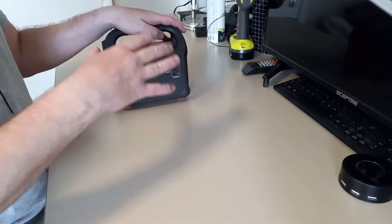The system I've designed to continuously run the refrigerator is this Jackery. This is a power station — basically a camping battery. This is the Jackery Explorer 160, meaning it's a 160-watt power station. It's currently at 85% charge because I've been testing how much energy my refrigerator uses when it's running and when it's idling. My refrigerator, when actively cooling, draws about 80 watts. This power station is rated up to 150 watts continuous, so it won't be overloaded — it'll handle it just fine.